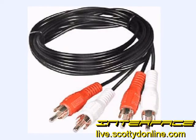Let's talk about what you'll need to get connected and up and running with your stereo receiver. Components are hooked to the receiver using RCA cable — this is coaxial unbalanced audio cable. Coaxial means the cable has a center conductor surrounded by a shield. They're referred to as RCA cables because they have RCA plugs on either end. Most stereo components come supplied with cables, however they tend to be rather short. If your components are going to be located some distance away from the receiver, you may need to invest in longer cables. Be careful though — really long runs of unbalanced RCA cable can pick up hum and interference.